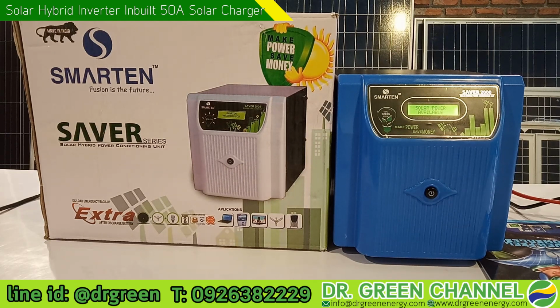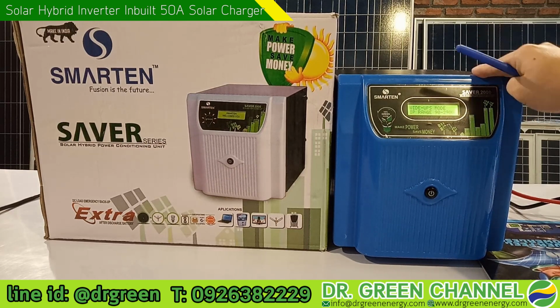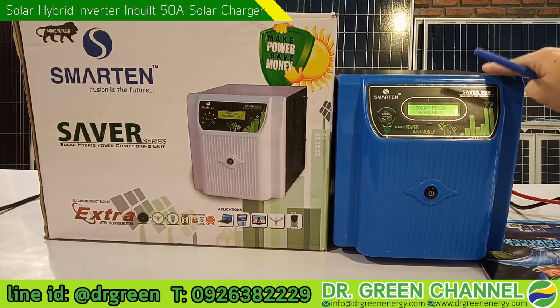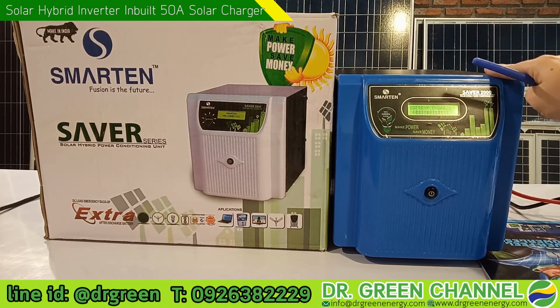You are watching the Dr. Green channel. Today we are going to show you the solar home UPS, or the hybrid solar inverter, whose size and capacity are bigger than the previous model. The capacity of this inverter is 2 kVA, or 2000 VA, with a 24 volt system. For this solar inverter, you need to connect at least 2 batteries in series. So you will have 24 volt output from the battery, then you can connect the power cable to this inverter. Then this inverter will start working.